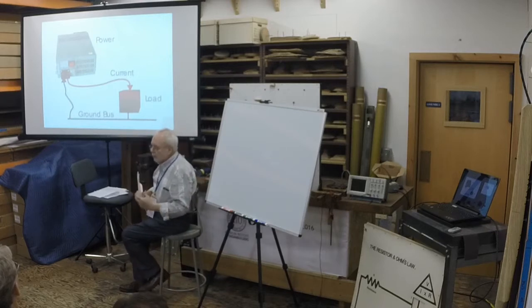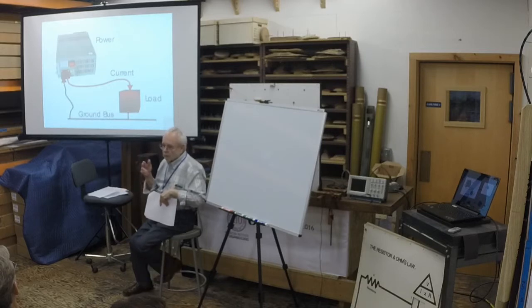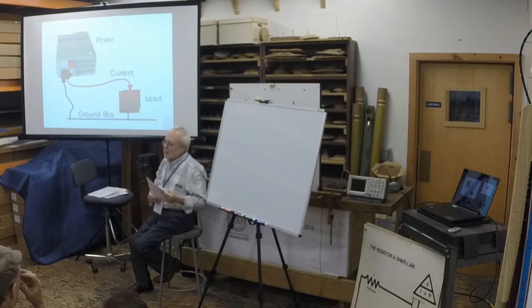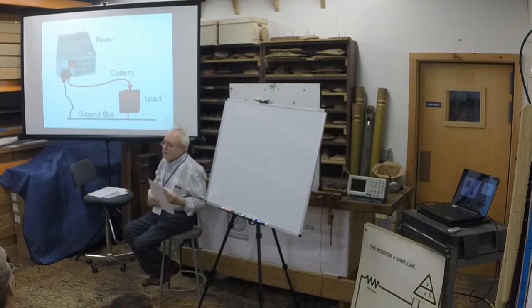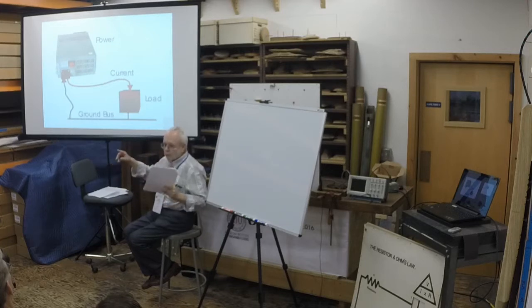Many of you may be aware that it's been advised by some solid-state manufacturers to clip the wire inside Astron power supplies that links its negative terminal to earth. How many people do this or know about it? Yeah, of course. I like to explain to people, well, you don't want your organ negative floating all over the building, do you? Oh, no. Anyway, it's been known to cause problems because it develops a separate ground bus within the organ apart from whatever you may have installed.